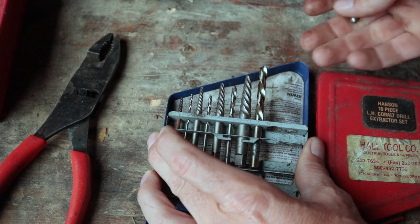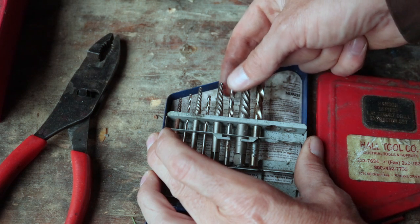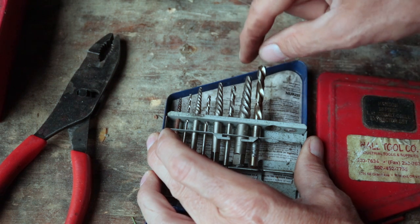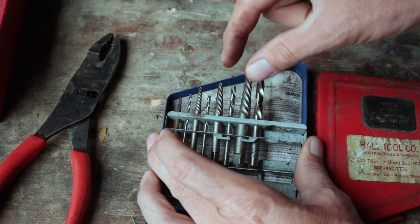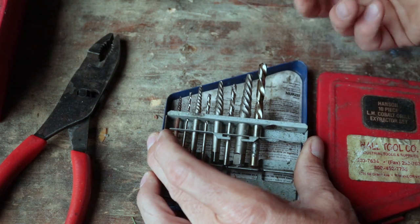The older, better ones had a left-handed drill bit, meaning it cuts while the drill is reversing. In my experience, 50% of the time the drill bit alone will back the broken thread or bolt right out. The right-hand traditional twist bits I don't like as much because as you drill in, you're increasing the tension and continuing to tighten it. However, sometimes if you watch closely you'll see it shifting — the vibration of the drill bit has broken it free — and it works pretty good.